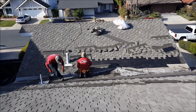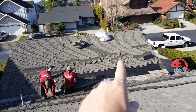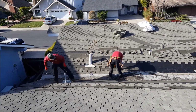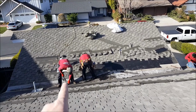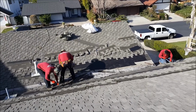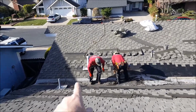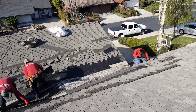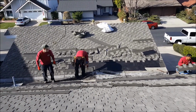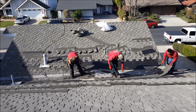So if you have your roofer out here, a couple most important things. You have a cricket done on a presidential TL roof. You got to make sure that they stack them all right above so they go back exactly where they do. Otherwise you're going to see a ton of shadow lines. It'll look like garbage. You got to make sure that this cricket gets completely torn out. This one that was put in last time went over the old one. So if you think, oh, of course everybody's going to tear these out. No, they don't. You're going to see that there's another cricket right underneath here. There's 2 here, I can promise you that. I always do. They're always taking shortcuts. This right here is not a shortcut. So we'll follow up and take some pictures. We'll show you how it comes out.